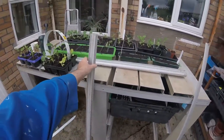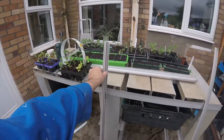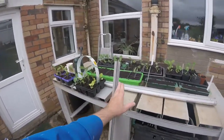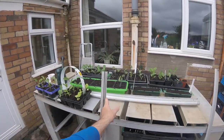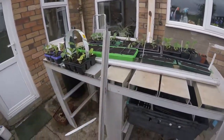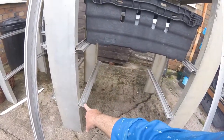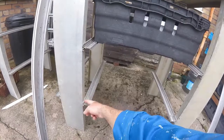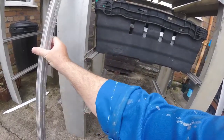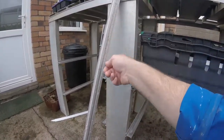A lot of greenhouses in the UK, aluminium ones, tend to have standard fittings, so you tend to get this sort of material which is standard. These would have accommodated the glass, held in by spring clips on each side. All I've done is cut these pieces to length to make tray supports between the legs, and then I've drilled through the upright of the legs to accommodate a bolt. The bolts are the ones you use on greenhouses - they're specially shaped and fit in this slot, and they slide up and down to whatever position you require.